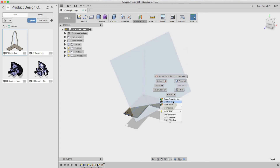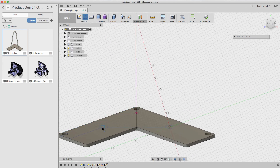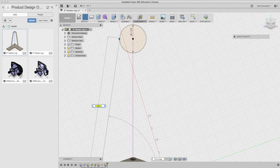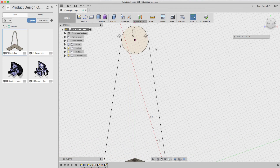Once you have your plane, right-click and hit Create Sketch, then create a circle using the shortcut C on your keyboard. We're going to create a circle 1.125 inches here. The reason we're not going all the way to the top is we want to factor in the thickness of our rod. To finish our center line, create a line from the middle of the circle tangent to the top circle — you should see the tangent icon pop up — then do that on the other side. Trim out the middle of the circle so it doesn't cause any problems when we use this as a center line.